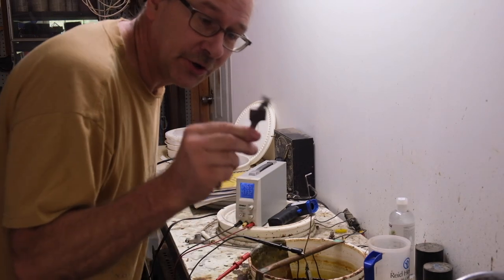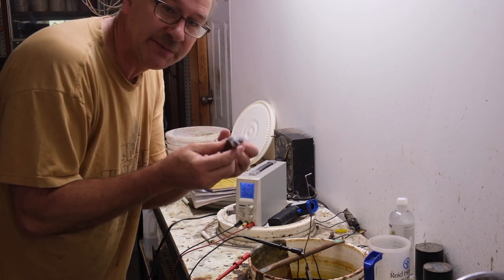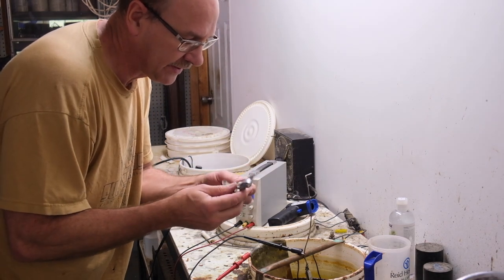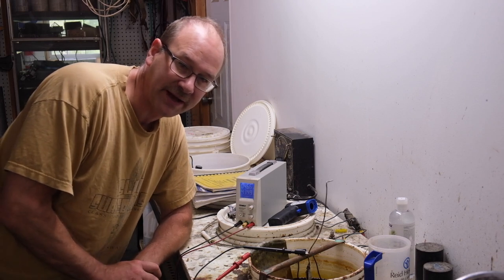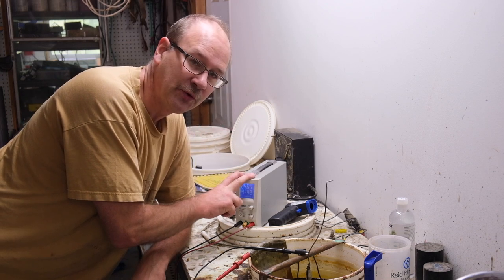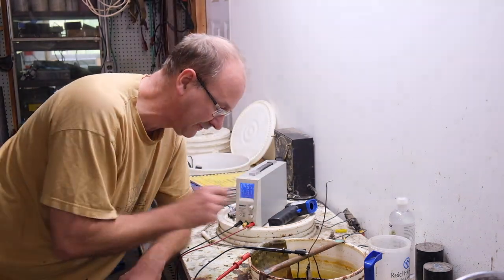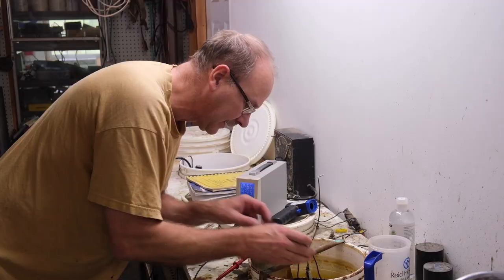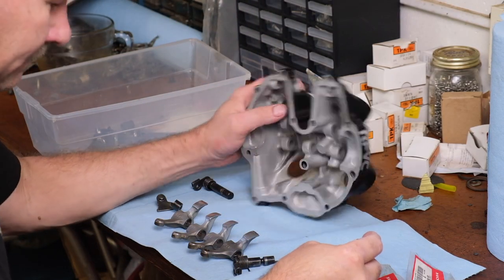That's the result of a successful hard chrome on the tip of these lifters. I'm in the process of doing the other one now. I've done these two as guinea pigs - I didn't need these because I had these. I actually only need one. I've got three lifters, got into old stock. Had to use a different power supply because my homemade one has too much ripple since it's homemade and only has capacitors to filter out the AC. For hard chrome you really have to pay attention to the ripple, so I got a laboratory-style power supply - it's only up to four amps, so it doesn't have to carry much amperage at a part this small.